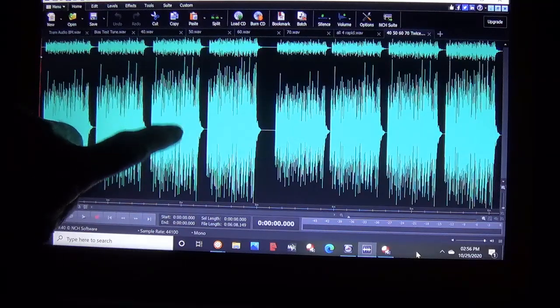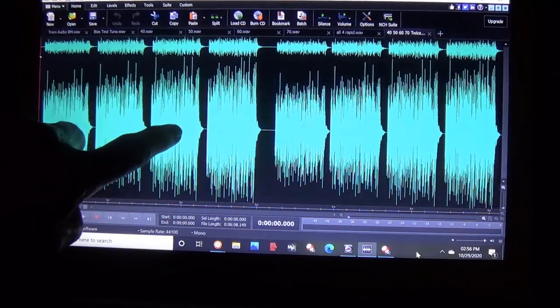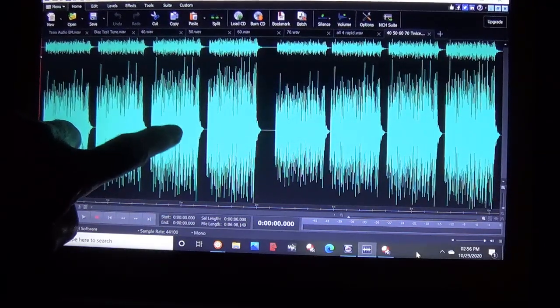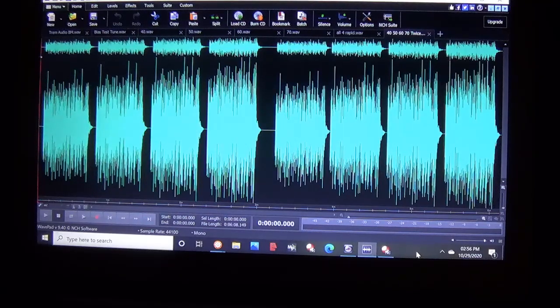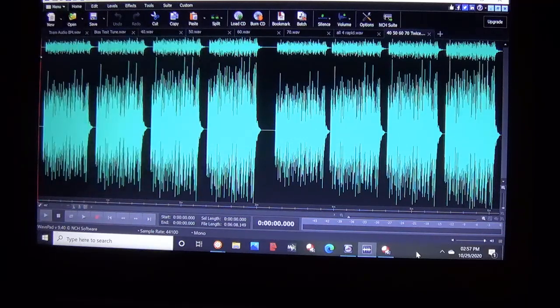If you felt that the tone at 60% was just about as good as at 70% and you want to bias your tubes a little cooler to make them last longer, more power to you. Like I said, this is a personal choice that you can make. But I think we have accomplished two of our three goals. We have provided data here that can help us assess the tone at four different bias levels. Also, we can assess the relationship between the amplitude of our output signal and the bias percentage.